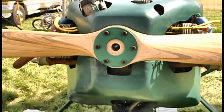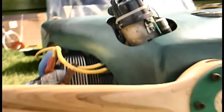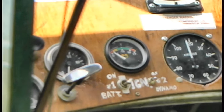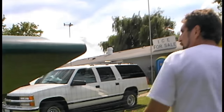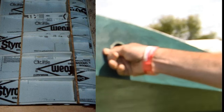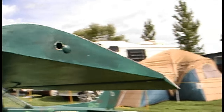Let's get back into the construction of the airplane. What type of construction are you using in the wings? They're styrofoam wings with a wood plank spar, using foam ribs — basically the airplane is shaped in foam and then covered with fiberglass. So the wing covering is not like Stits or Ceconite, it's fiberglass? I took a little inspection cover off where you can see inside — it's regular building insulation styrofoam, blue styrofoam, that you buy at the hardware store or building supply. It's just a cheap way to build a good, strong airplane.